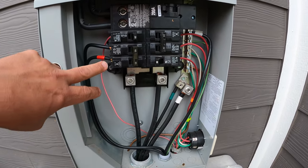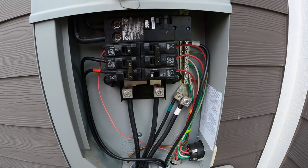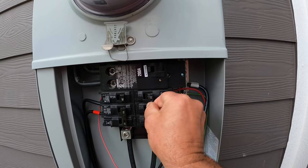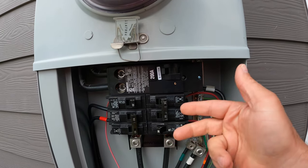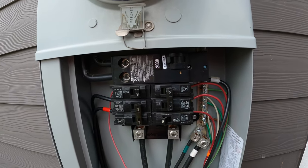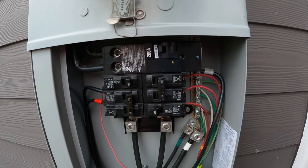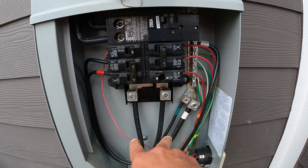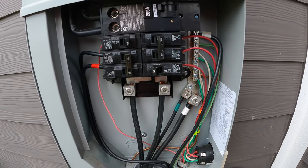As you can see here, this is our hot tub 60 amp panel. And over here, I've got a 30 amp breaker that I use as my generator disconnect switch. Each circuit here will feed one side of the bus bar, so I can capture this left side and this right side, which in turn feeds both sides of my bus here. So I'm getting 120 volts here and 120 volts over here, feeding out into my main panel.